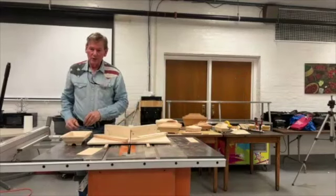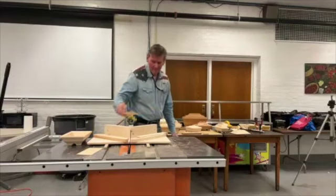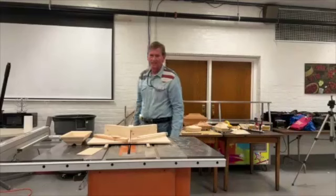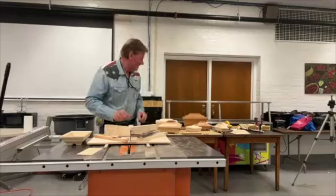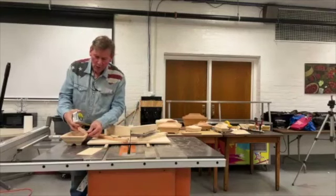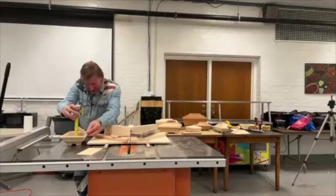You have your base put together. You need three measurements from this piece. This is as complicated as the math gets. A minus B plus C. That's the most complicated math you're going to have to do. A is the total depth. Place the molding the way you want it on the box. Measure from the depth of the box to the very top. In this case, 3 1/4.